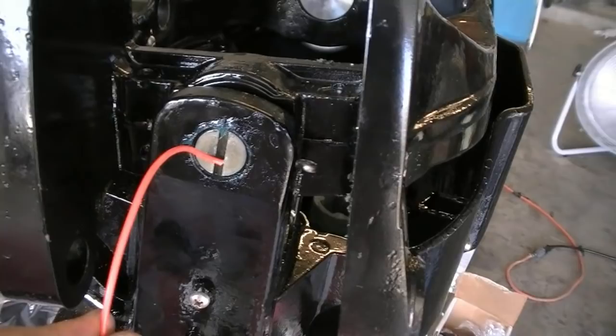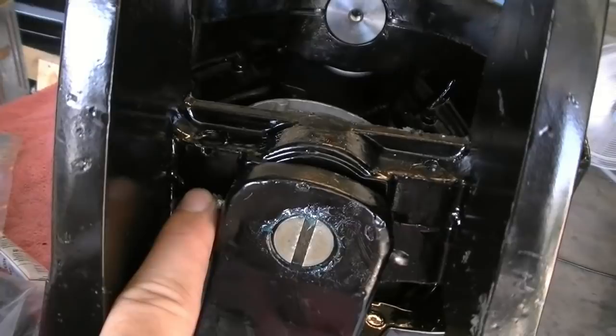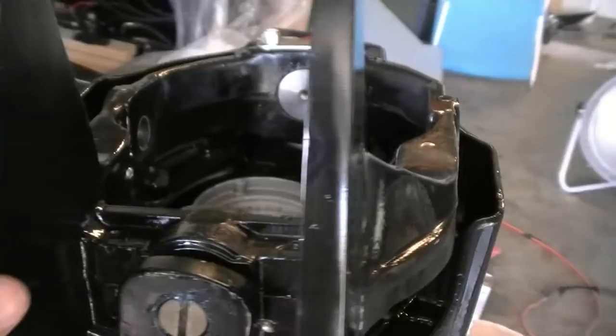We also used beforehand a little red piece of wire to go in and make sure that you're lined up before you go hammering on this. So it goes all the way through - we made sure it was lined up and then we hammered in this cotter pin and bent it over on the other side. It only sticks out about a quarter to a half inch on one side and about an eighth inch on the other, so you have to make sure that you bend it over nice and good. Now we're going to go up and finish tightening the steering pin to its proper clearance.